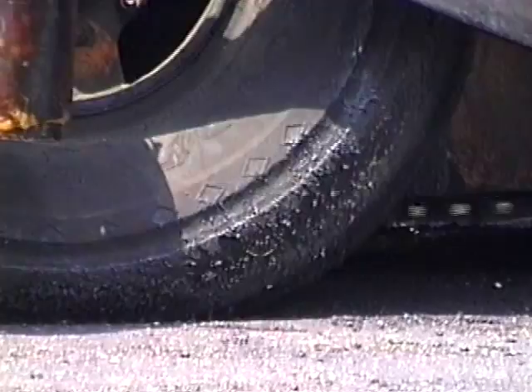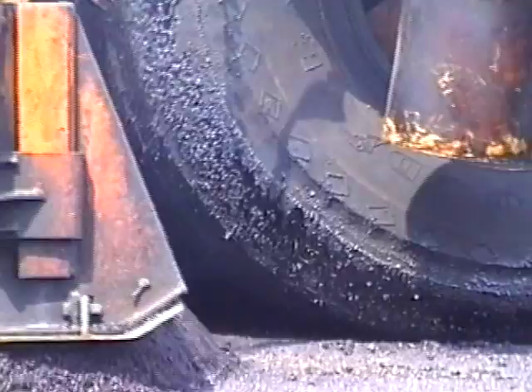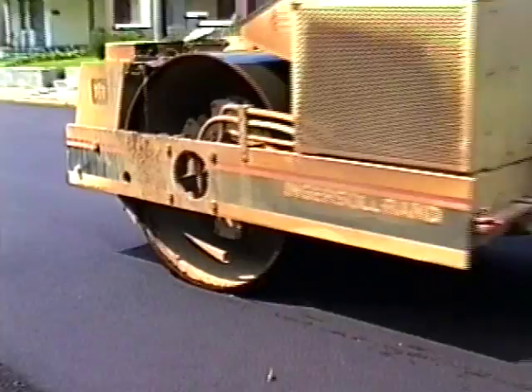Notice how as the truck and paver drive over our riser, there is no movement of riser in frame. This is because our pivoted turnbuckle ensures full circumferential engagement when expanded in frame. This is a very reliable installation, similar to a pressed-in bearing fit. The new asphalt is now compacted using a 12-ton roller, and the utility structure has been successfully and efficiently raised up to new grade.